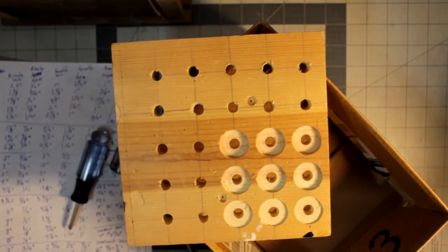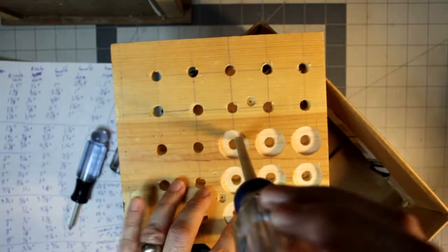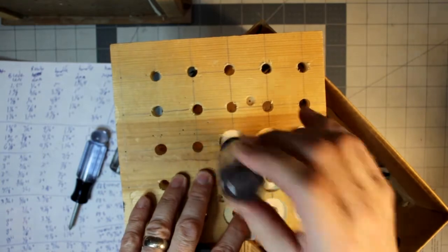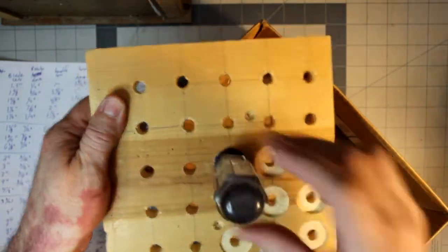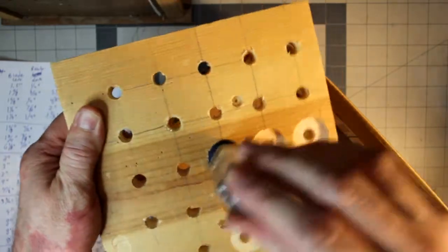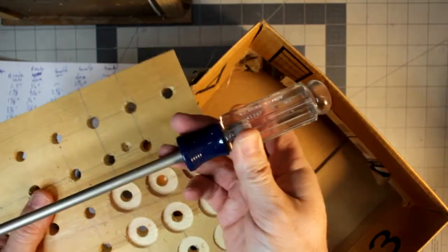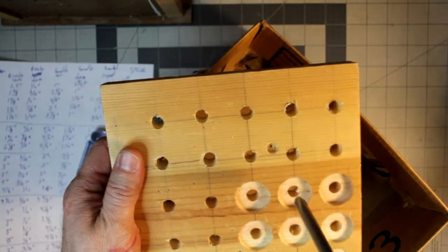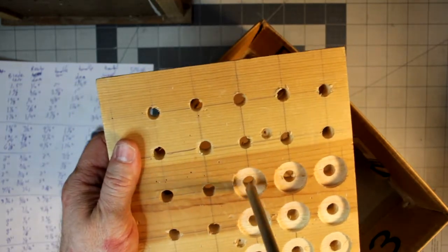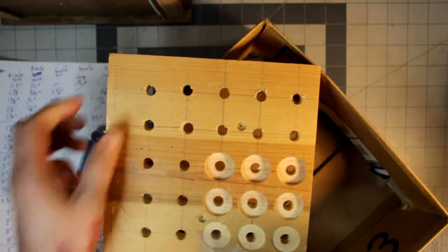Meanwhile, if I take, say, a larger one, let's see if I can find one that's going to be bigger. The problem is, of course, it won't. I'm actually hitting the bottom of the box, not this. But I'll hold it up. It works out a lot better. The inset doesn't work, though, because this is an inch in diameter, so it's not fitting. It actually would need to be bigger. And I don't really have a Forstner bit that's going to work for that. So I was kind of considering skipping doing the insets. This works out pretty well, though, for this size. So what I may end up having to do is...